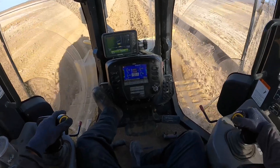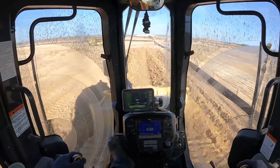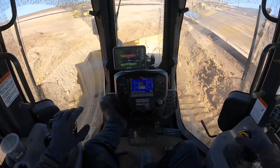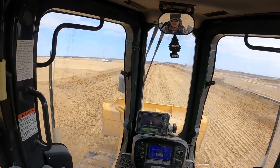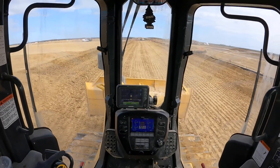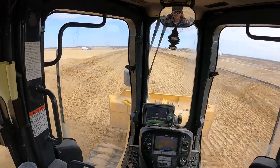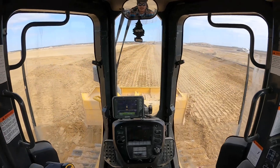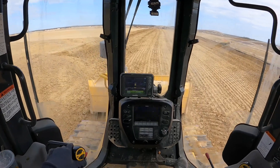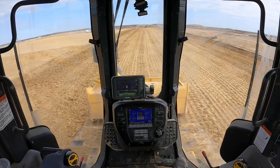I'll keep working this and we'll take a look at what it looks like when it's done. All right, so now you see this is how I left it after I worked it — this is how I left the ground. Now we're going to cut off the top so that it's nice and smooth. We were processing at negative 0.9296 and now we're going to cut around negative 0.4247, maybe even 0.37 in some spots.